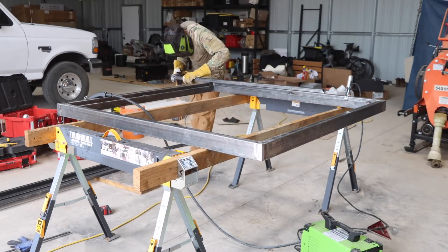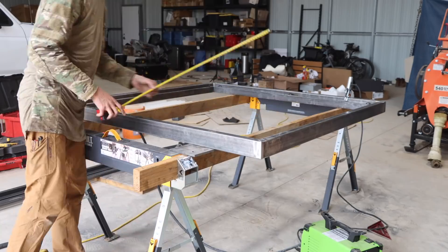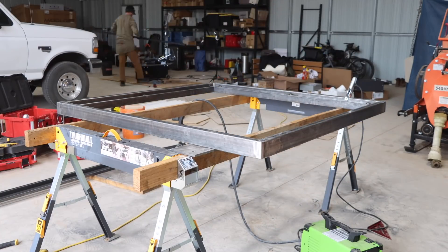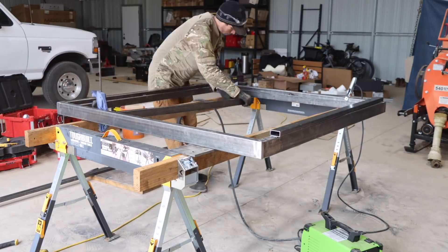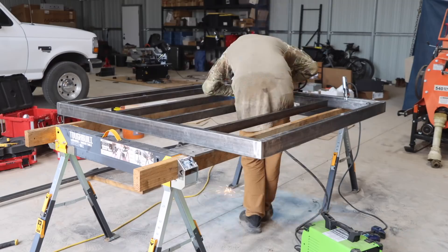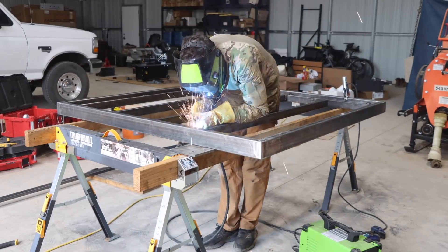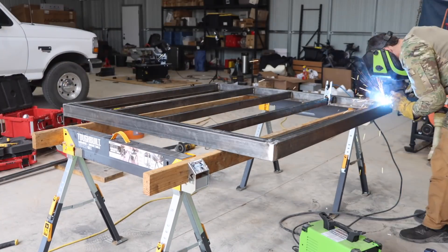I'm adding pieces here that are two inch by one inch. Between the top of the platform and where the plywood is going to rest, there's an inch gap — so you're not going to see any edges of the plywood and no visible screws through the bottom. Everything is hidden within these pieces going around the perimeter. The pieces I'm cutting now are kind of like the joists going through the center. If you're wondering why I'm using a plastic clamp instead of a steel one — I'm just using what I have right now. It doesn't stop me from getting it done.